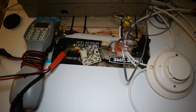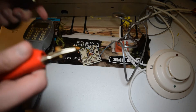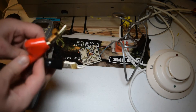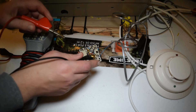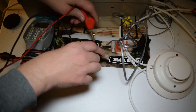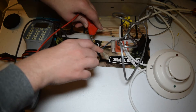Now we're just going to quickly verify with the telephone test set that we've done it correctly. I've connected the phone line at the other end as well, connected it to phone service. Taking my two alligator clamps on the test set — black is tip and red is ring — black is going to go on the blue wire and red is going to go on the red one. And we get dial tone, so we have the order correct.